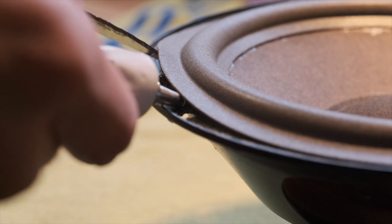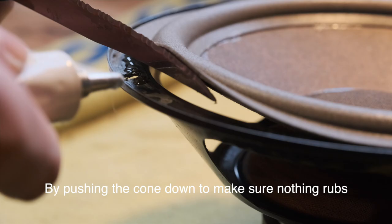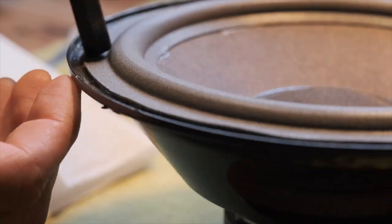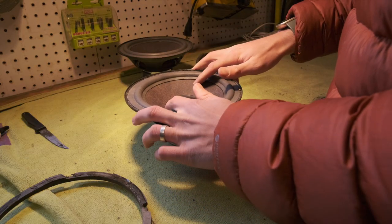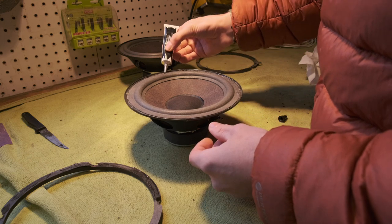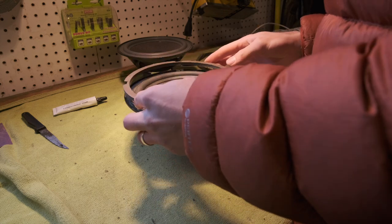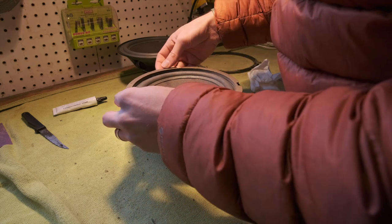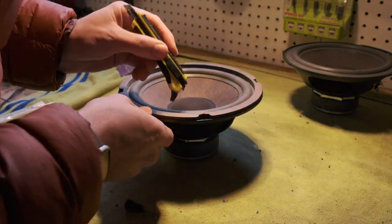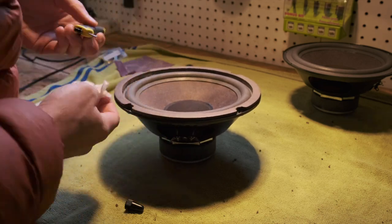I finished one speaker the night before, so there's just the foam rim left on this one. Sergi glued the middle. You put a thin line of glue all the way around the metal basket under the lip of the foam, then use the butt of scissors or something dull to push it down and give a nice seal — you could even use clothespins overnight, though on a smaller driver that's not really necessary. I'm testing this driver to make sure there's no rubbing. If that voice coil rubs on the magnet it'll make distorted noise. On a smaller driver like this you don't need shims to center it, but on larger drivers you definitely want to remove the dust cap and use shims between the voice coil and magnet. Since it's not rubbing, we go ahead and put the gasket over the foam and let both drivers sit a day or so to cure before playing music.